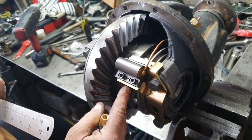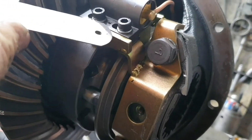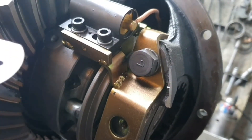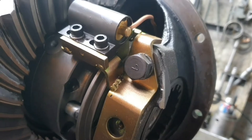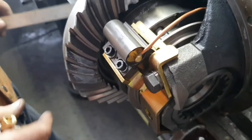You've got a tapped hole down there, but that's pretty useless. Because if you put a bolt in there, you've got to dimple the aluminium — it tends to push it over. That's a better way: just drill it with a one-eighth roll pin.